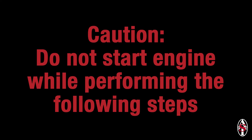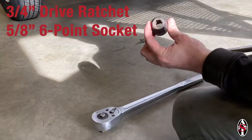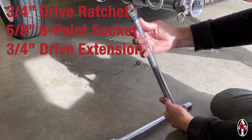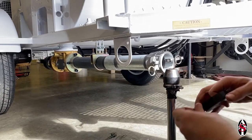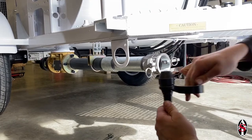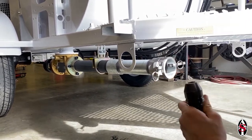The tools needed to complete this operation are a 3/4 inch drive ratchet, a 5/8 inch 6-point socket that is 3/4 inch drive, and an extension. We recommend using electrical tape to reinforce the connection between the socket and extension. Sometimes the sticky mud in the tube can create a vacuum effect and suck the socket off of the extension as you draw it back out. A few wraps of electrical tape can prevent this from happening.